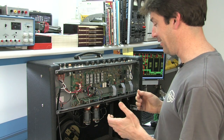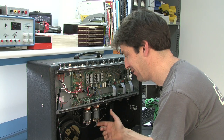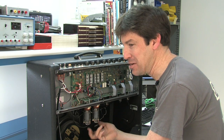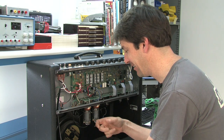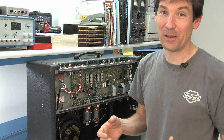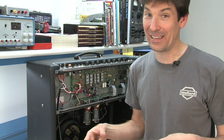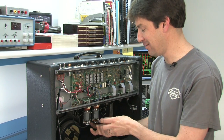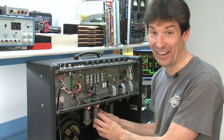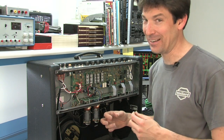So as I turn it on, it's nice and running. You don't hear anything until I tap the tube. It sounds like a rubber band or a spring or something inside. That's what a microphonic power tube sounds like, and you'll hear it a lot, especially in older amps. If you knock your amp around, or if it gets knocked around, especially if it runs on casters, it'll loosen the spacers inside the glass. It didn't get a good solid connection inside the glass, so it's vibrating inside there. And that's just one indication the tube is bad.